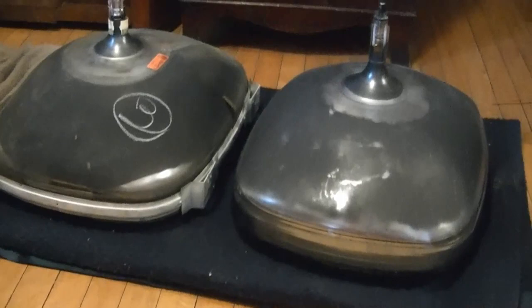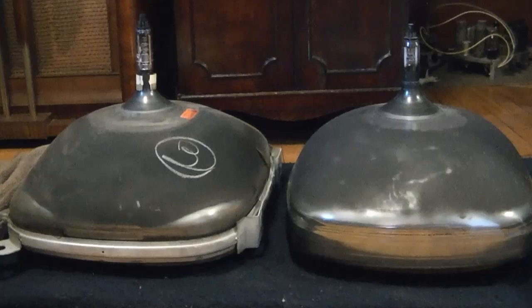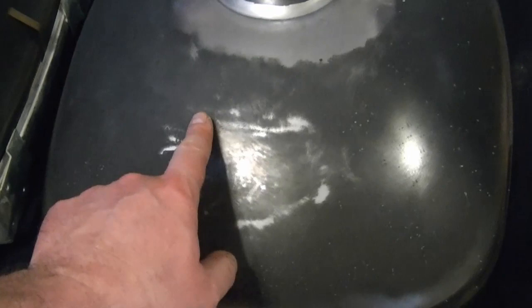Here's the old CRT on the left and the new one on the right. There are slight differences in shape: the new one is just a little bit shorter on the neck and the curvature is slightly different, but otherwise I think it will work just fine. One thing I want to do before installing it is address the conductive coating on the outside, which is worn away in some areas. So I'm going to spray on some Slip Plate, which is a conductive graphite coating.